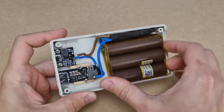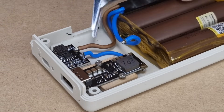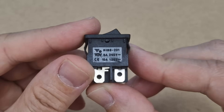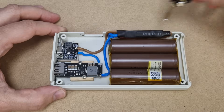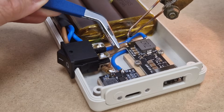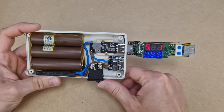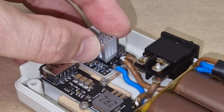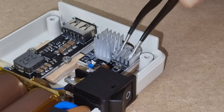After 10 minutes the glue is dry and I can start soldering the rest of the components. Since there may be high current consumption from the battery, I will use thick wires of 2.5 square millimeters. That's also why I decided to use this rocker switch — it can handle a lot of amps, and it has two poles which I will connect in parallel to double the rated current and minimize power losses. The charging module is designed without a heatsink on the IC, but I will add one anyway because the module is mounted inside a closed enclosure. I will also add a second heatsink on the inductor to help with overall cooling of the module.